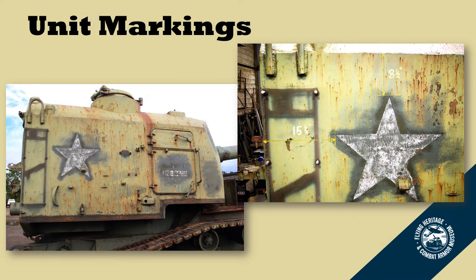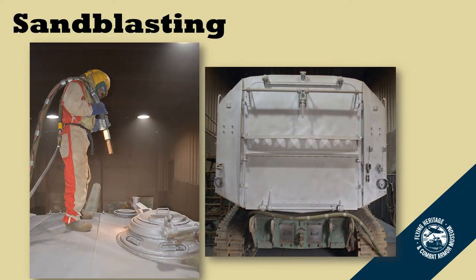One of the very cool things about doing restoration work is discovering the history of the artifact. I was able to find some of the original markings — here you can see the star on the turret, the registration number on the door, and on the back of the turret I found some very obscure and hard-to-decipher unit markings. Here we are in the middle of sandblasting — I'm up on top of the turret, and in the picture to the right you can see the back of the turret has been blasted while the bottom of the hull has not, showing the contrast. We used steel grit as a blasting media, which is reusable and leaves behind a really nice clean profile that provides an excellent surface for the paint to adhere to.